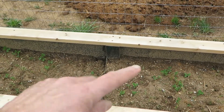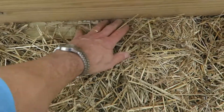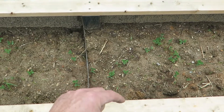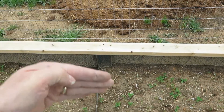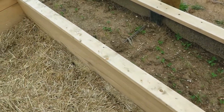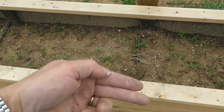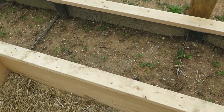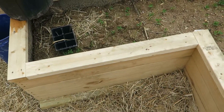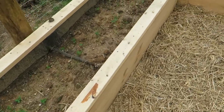When I put the plastic on, I put it all the way down right over the outside four-by-four — you can see the four-by-four down here, flush with the inside two-by-ten. I ran the plastic straight down and wrapped it around all of these pieces so it's all kind of watertight. I didn't put any excess staples in it. Most of the stapling was when I wrapped the plastic over the top before I put the two-by-four on. I screwed everything down with deck screws.